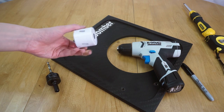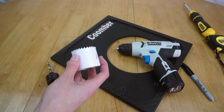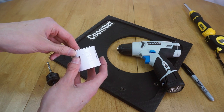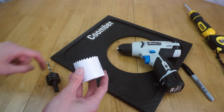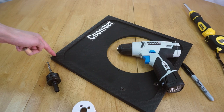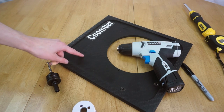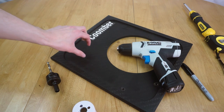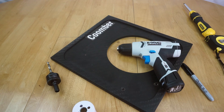So I've got a hole saw. This is a 51mm hole saw. The speaker says it needs a 45mm cutout, so this is the closest I have to that, and that's still small enough that it's not going to get in the way of the screw holes. And I've worked out here the center point between the main speaker and the outside, lined up along the diagonal exactly, and that's here. So if I drill a hole here, that should mount the tweeter in a nice, sort of central position on the device. So yeah, time to get drilling, and hopefully I come out with 10 fingers.